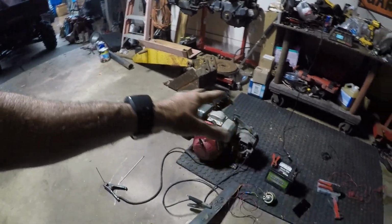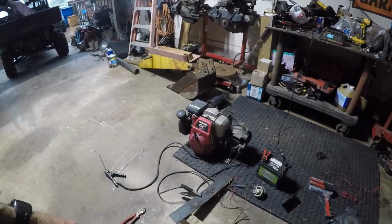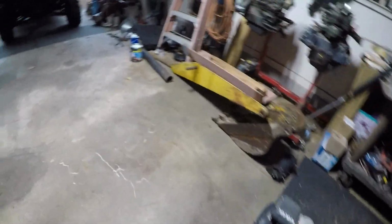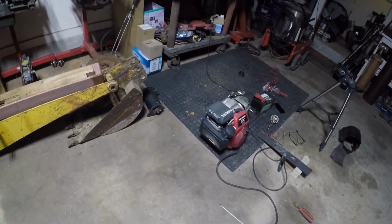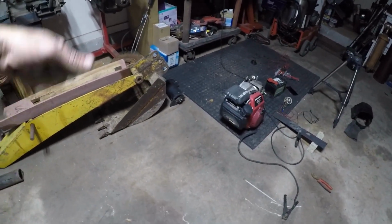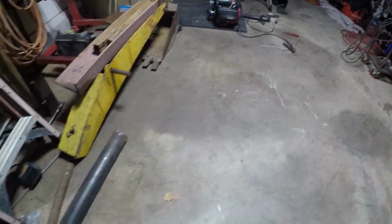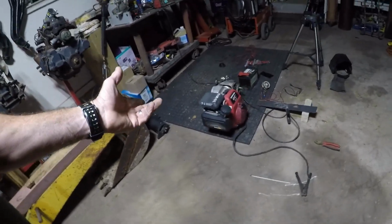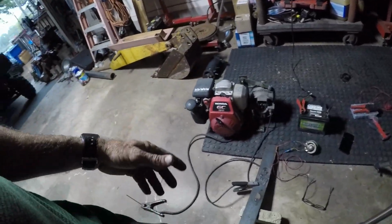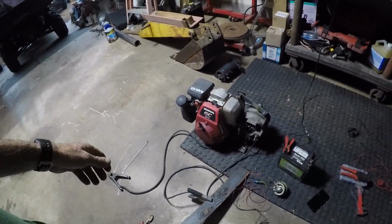And I think even adding wheels and stuff like that, it's not going to add a lot if you just put little bitty wheels on it. And it really doesn't even need the wheels. You could actually just have 4 legs, because that's, again, the whole point, where you just pick it up and set it right next to where you're welding, where it also doesn't need that long of a lead too. Those little leads there are like 4 foot long, 5 foot. Well, that's all you should need. Because you're not going to be making a living with this, you're just going to be doing little minor repairs or just homeowner type stuff. You could just set it right beside what you need to weld.